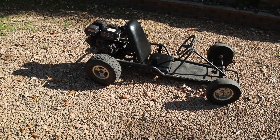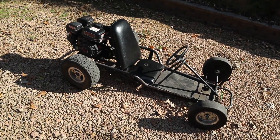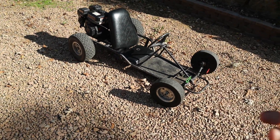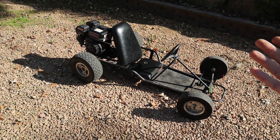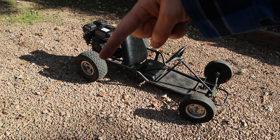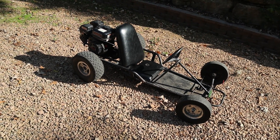This is a Manco Dingo go-kart with a one-inch rear live axle in the back. Since it's a live axle, both wheels always turn at the same speed, which isn't necessarily the best for turning with a stock engine. But my rule of thumb for off-road go-karts where you want a better turning radius: add more power. That tire breaks free, the other tire breaks free, and you turn a lot better. It's amazing.